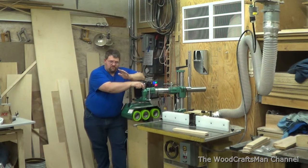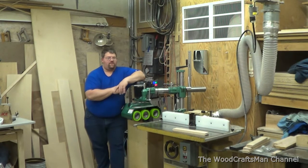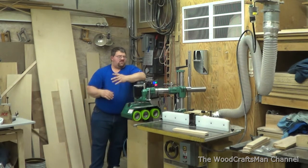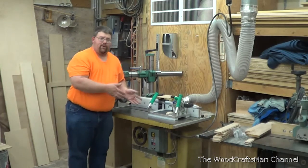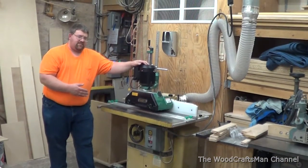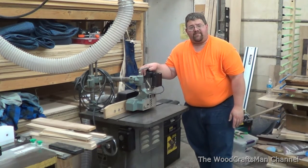It's going to be strictly a door building video, and you'll get to see this new door and drawer front that we had made for 2015. I'm going to show you the 4 processes, and those processes are the coping process, the sticking process, the panel raising process, and the outside edge perimeter profile process.